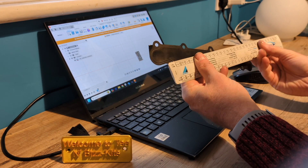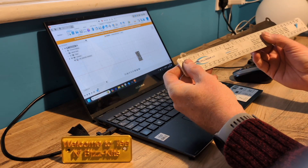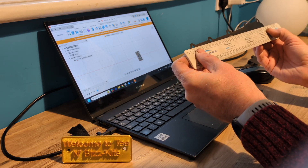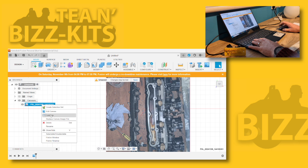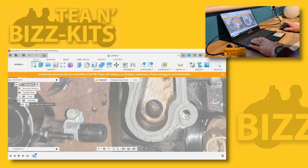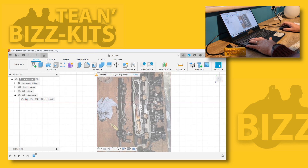What we're going to do to start off with is grab a rough measurement. I'm going to grab from this very top corner here to the furthest point away, which for me is 254mm. So when we go in here, we're going to right-click and go to calibrate. I'm going to pick up at this triangular point, to the furthest point away, and say that's 254mm. That's going to be roughly calibrated. Now one thing it hasn't done is obviously your x-axis and y-axis might be out, and we can just quickly check that by sketching on that plane and dropping in some points.